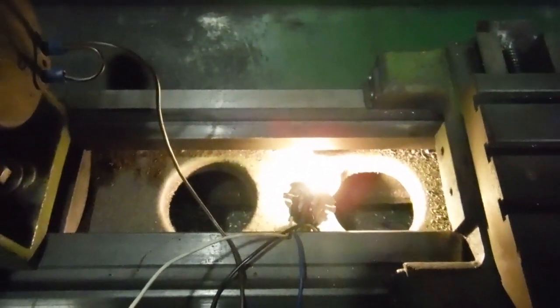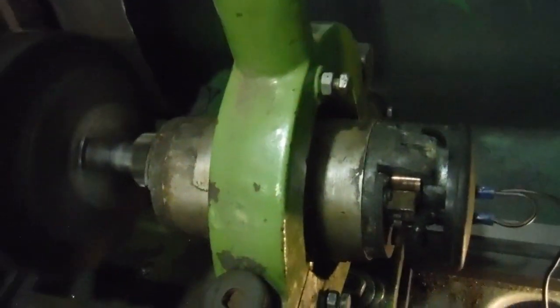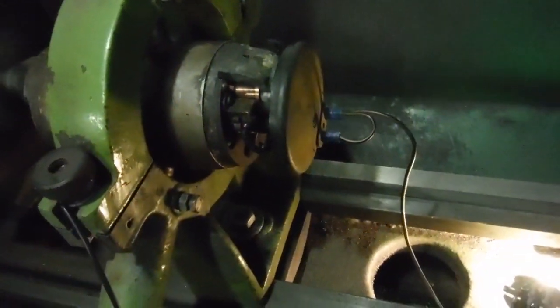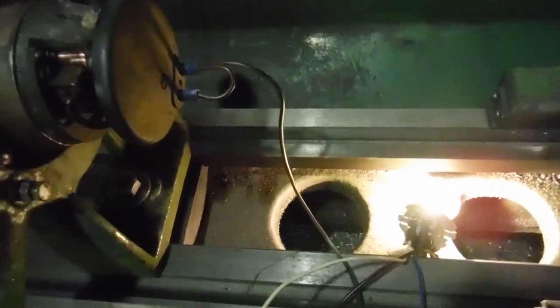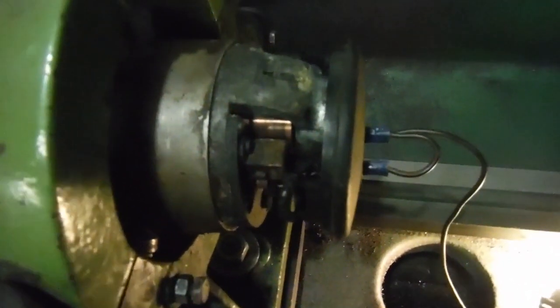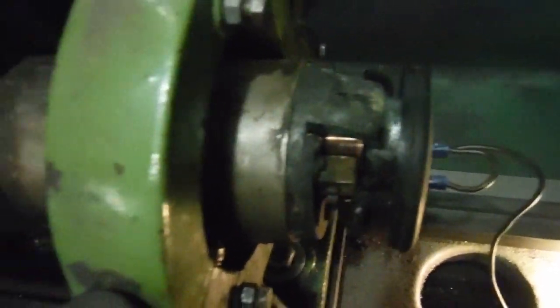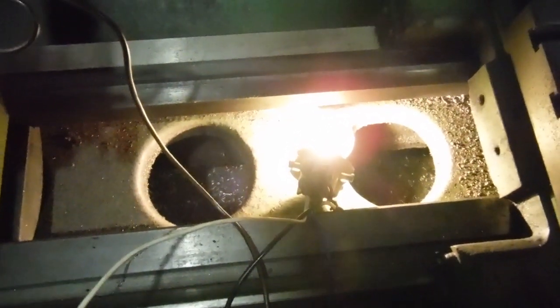There's a dynamo that probably hasn't done anything in about 60 or 70 years. It came from a mag dyno off a really rusty old bike that came from the scrapyard and was almost rotted away to nothing. I cleaned the brushes and the end of the commutator, and I'm spinning it at 2000 rpm in a lathe and it's lighting up a 12 volt bulb pretty brightly.